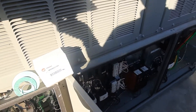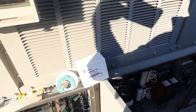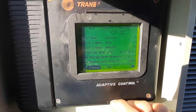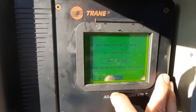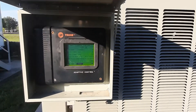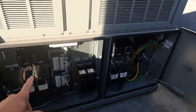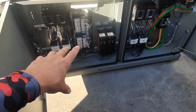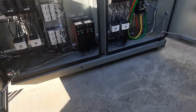To get this guy shut down, we don't want to kill power on these things. Anything with VFDs, we want to come to the control and hit stop — not immediate stop, that's emergency only — and let it stop on its own. Then we'll blow all this out and tighten all our connections. You want to give the VFDs time to discharge all the capacitors and everything inside, so give them about 10-15 minutes before you start blowing or tightening any connections on those.